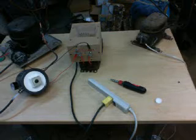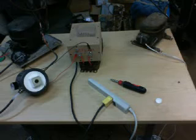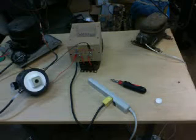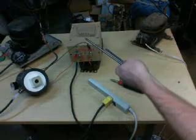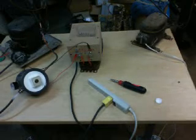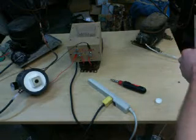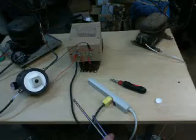I have decided that I'm thinking if we take two of these pumps. That one's actually out of a freezer. That one's actually out of a condensing unit for, like, getting the water out of the air. And I decided to hook them up in series to try to make this one pull a vacuum on that one so that we can get an even bigger vacuum.